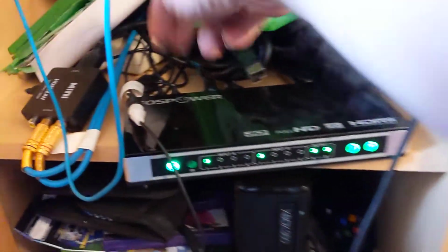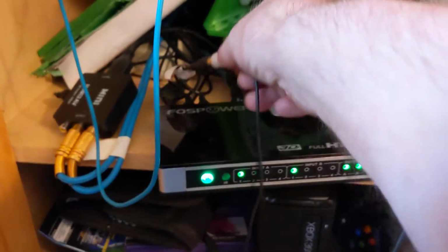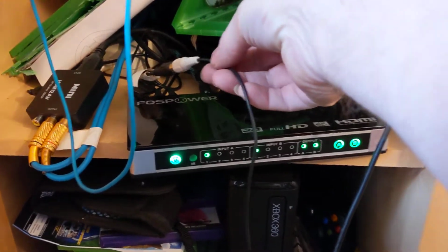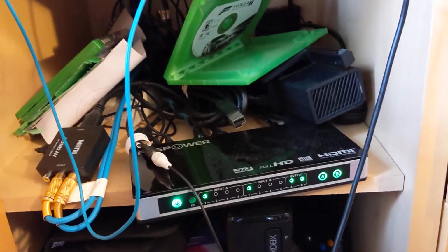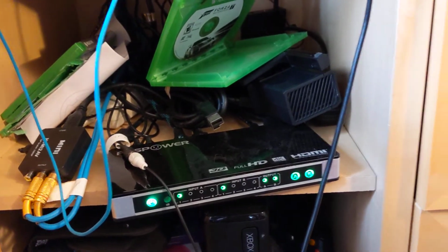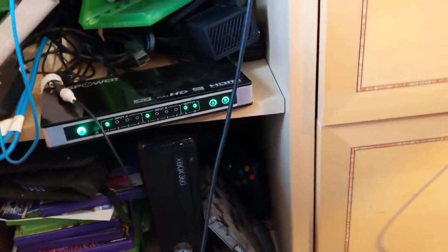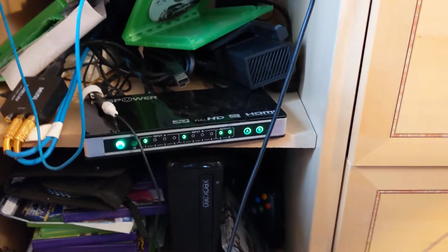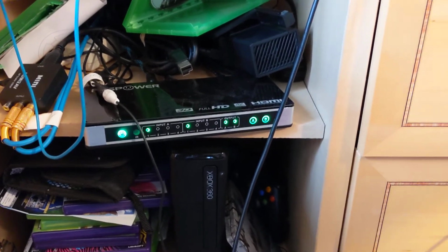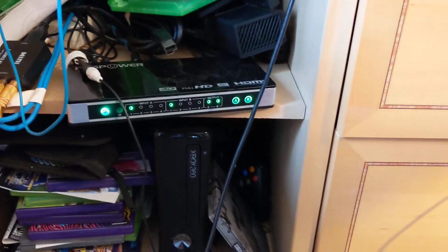I have an HDMI splitter that has an audio out that is driving this right now. So I'm having left and right audio out going to a Y, so that I'm sending a mono signal down the pipe just because I can. If you put a stereo signal into these amps, it'll mix them down to a mono signal, so that's good. And that's super important. You never want to drive this with the left or the right channel, because then you're driving along a track, you hit the bump strips on the left of a road, and you feel it, and then you cut a corner on the right side and you don't, which just sucks.